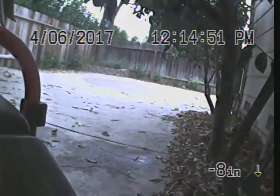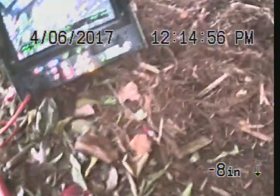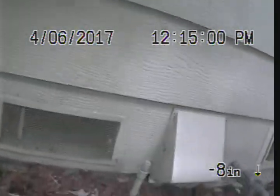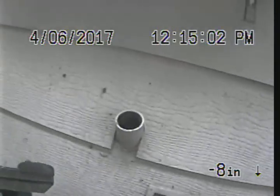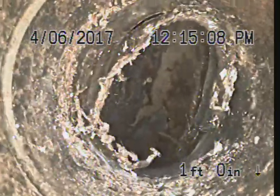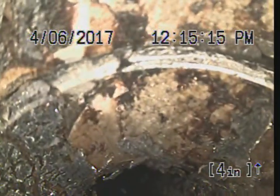House is being sold. There is landscaping that just freshly got done — bark and everything — so I looked around for a 4-inch clean out, could not find one anywhere. We're going to go through the 2-inch kitchen line, starting at 0 feet 0 inches, going out as far as we can. This is only going to be one direction because there's no two-way clean out.